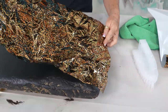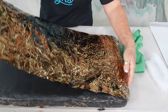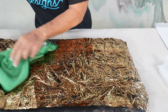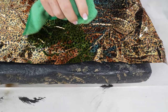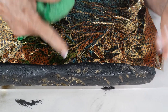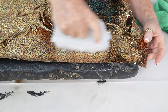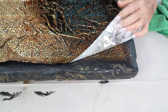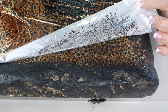I'm going to lay it down one end and very lightly with a towel or soft drag, just kind of lay it down. If I lay it down crooked, I can always burp it back up and readjust. I just want to tap it down to hold it in place. Now, I want you to pay attention — if I go all the way to the edge with my rag or scrubber, it's going to leave a hard edge where the foil stops. So when I transfer the pattern onto the substrate, I want to go about a half an inch away from that edge so I get a very soft edge, not a hard edge. That way, when I come back and overlap, you're not going to see a hard line.